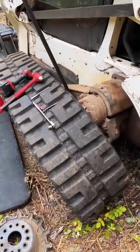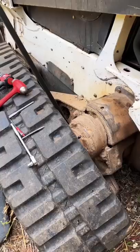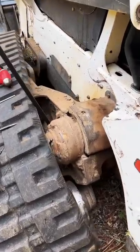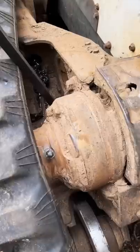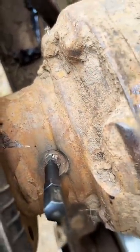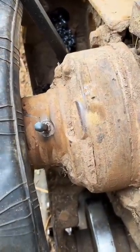I need to take this track off again anyway to service the gear oil and the drive motor on this side. They're supposed to be serviced every 500 hours, but the drain and fill plug — the head of the drain and fill plug — were completely worn smooth. No way to get a fastener on it, as you can see where I tried to chisel it off in the past. So I said to heck with it. I got to take it off. I'm going to take it off and do it all right here in the pasture.